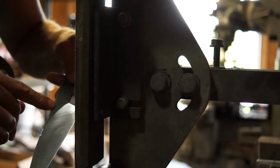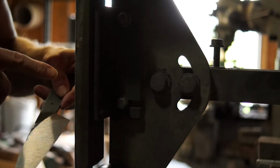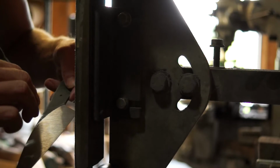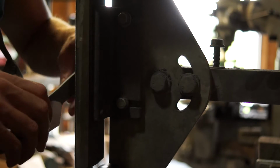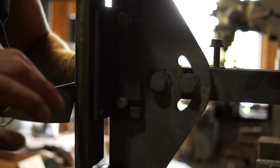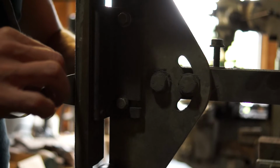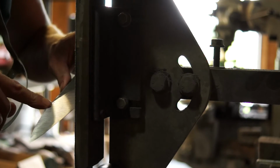And in a nutshell, I'm not going to do it with this belt. This is a 50 grit. I usually use the 120 as part of my cleanup, and I grind the handle flat. That way we have a nice flat surface to put the scales on. So I'll run that the whole way out until it starts to tip.